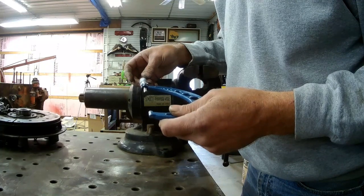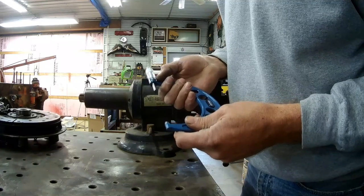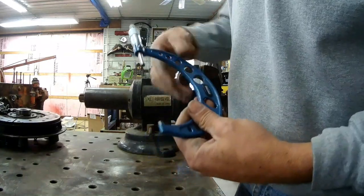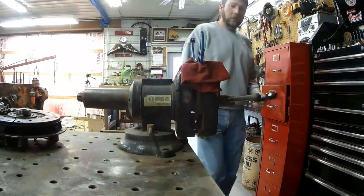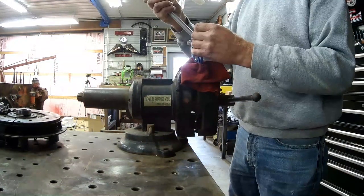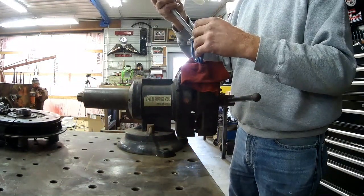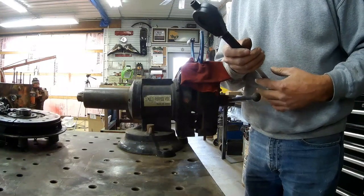It's a 4-inch bore. Let me get the micrometer set up, lock it in on 4 inches, clamp that lightweight device, and get the dial bore gauge set up. We've got that zeroed out at 4 inches.